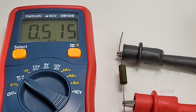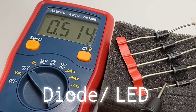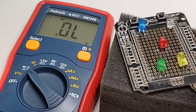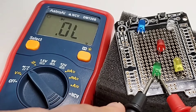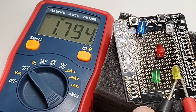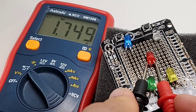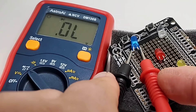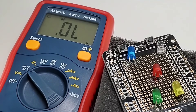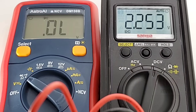Testing a 475k 1% resistor — coming up just over the 500 range at 515. Diode time: starting off with a standard diode, no worries there, there's that forward voltage drop. Let's get out those LEDs. Starting with the green LED — it is barely lit, but it is showing up with a forward voltage drop. Over to the yellow — same thing, barely lit but we have the forward voltage drop. Over to the red — also lit with the forward voltage drop. The blue — no, the blue is a no-can-do. And the white — same thing. So 3 out of 5 in terms of illumination. In diode mode the Astro AI DM130B is putting out a respectable 2.25 volts; 3 would have been even better.